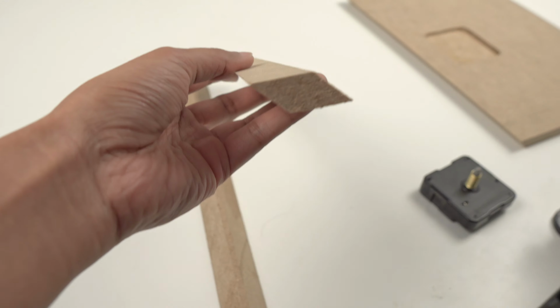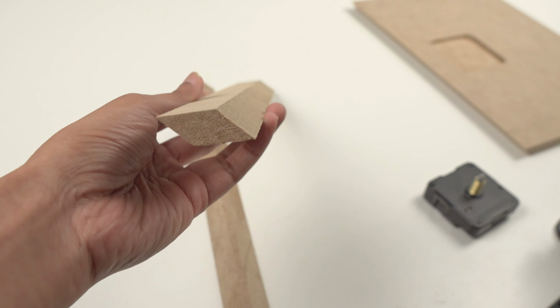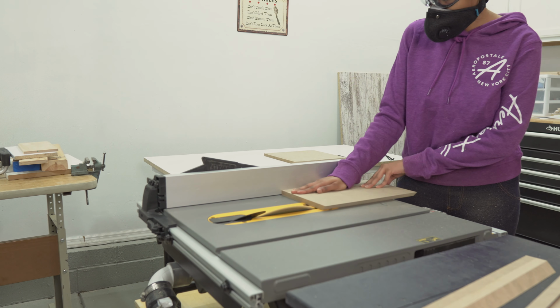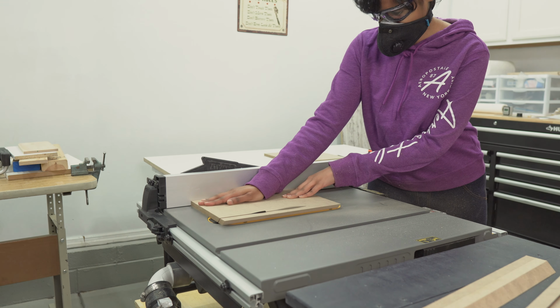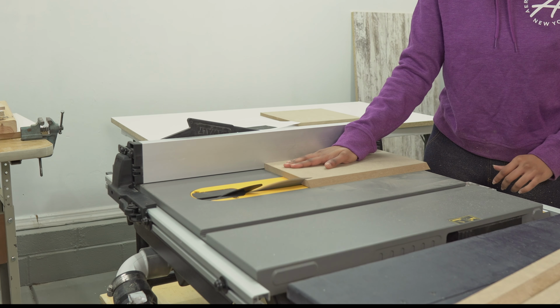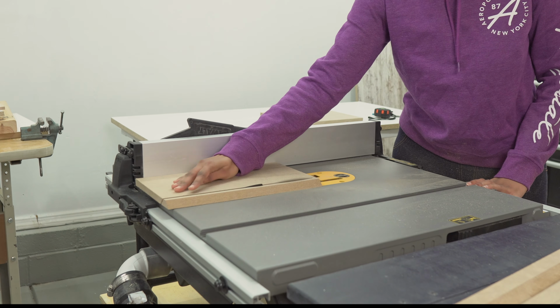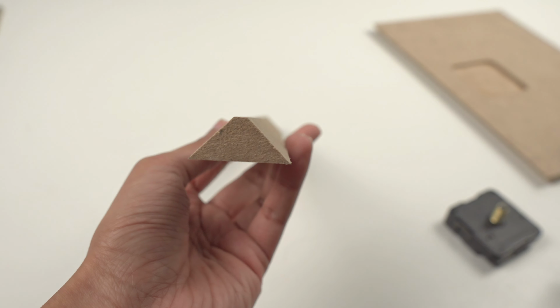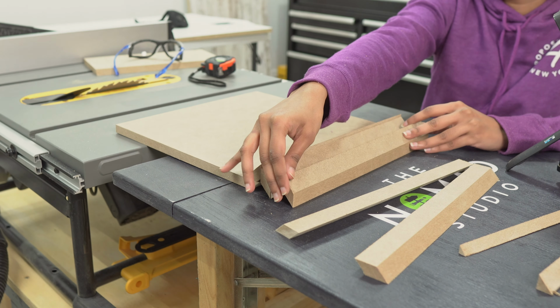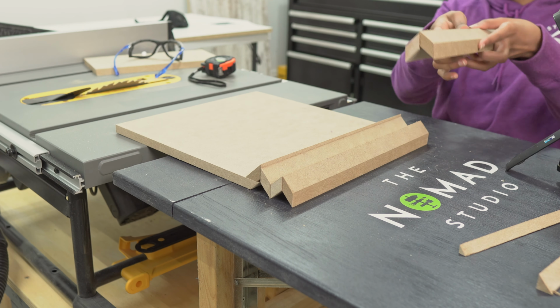I need 5 of these rhombus shaped pieces, and the 6th piece should look like a trapezoid. To do this, you have to cut 45-degree on one side and flip the board and make another 45-degree cut. It took me a few trial cuts to get the right height. Then I did some trial on how I want to arrange the folds.